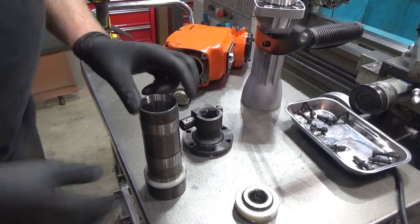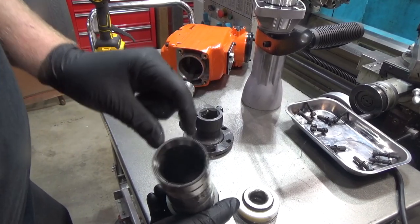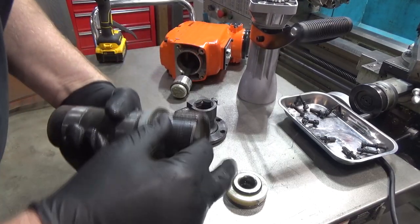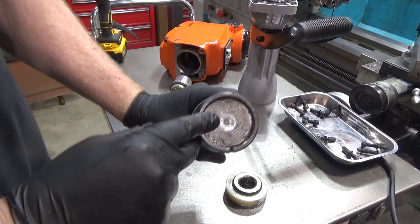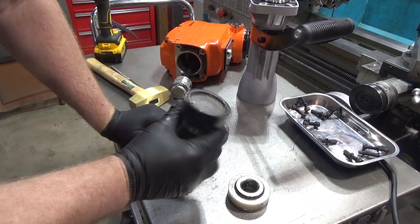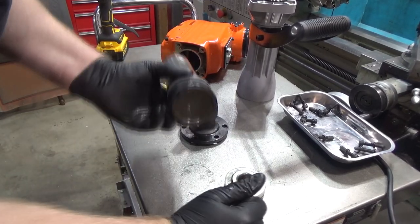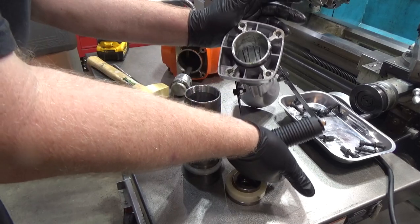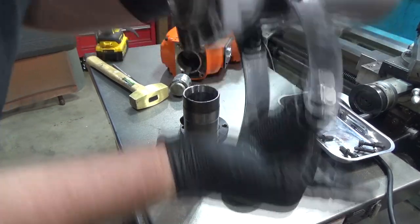The piston presses and pushes air around this end piece, with a rubber gasket at the back. You can see that the tool itself has been hitting right here because it's left marks in the metal. There's a rubber seal here and a backup gasket as if this whole end piece slides back and forth — and maybe that's it: as the piston moves back and forth it pushes this back and forth. If that's the case, this aluminum housing is going to have some issues at some point because you'd think that would need to be steel.